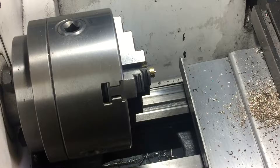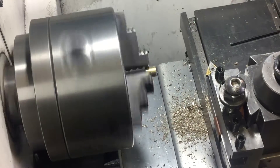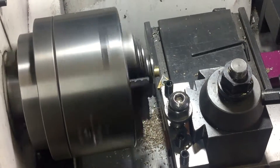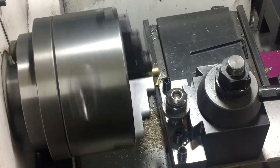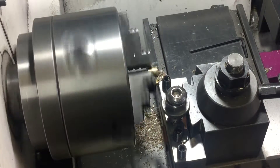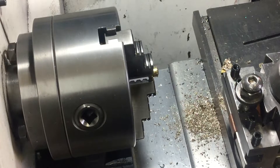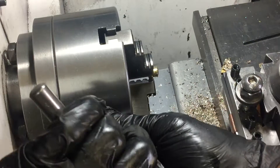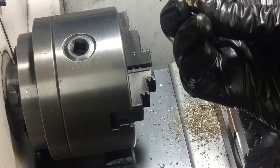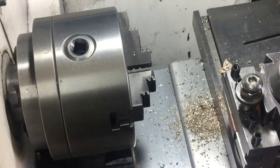Because they're so short, I want to just chamfer that end and also take the little tit off, so I'm having to be quite careful not to put too much pressure on it. Fortunately the brass cuts fairly easily. Right, there's one done — 13 more to do. It's a little tedious but good lathe practice and it's not complicated.